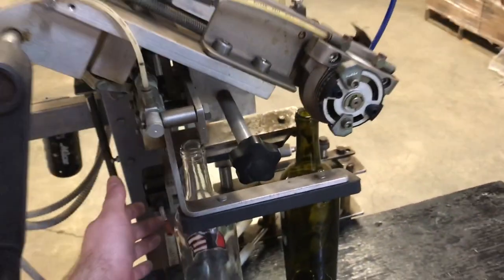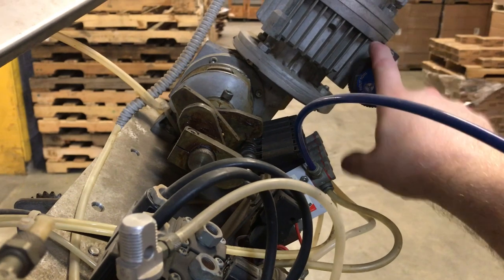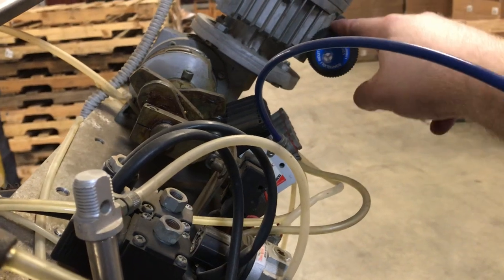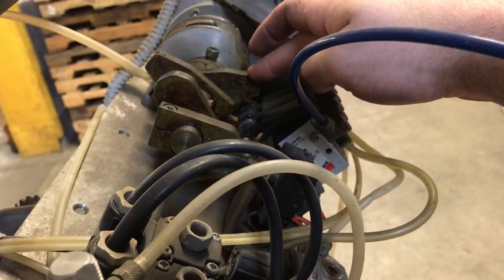So that's a relatively slow cycle. The way you can adjust the speed is by cranking on this — I believe left is faster, right is slower. Now this does not change any of the timing elements, it just changes the speed. To change timing elements you would have to change them on these cams, but I would not do that if I were you.